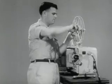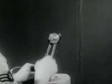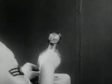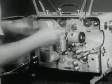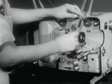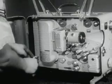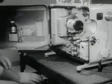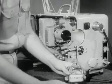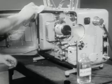It is a good idea to follow the same path as the film takes in your step-by-step inspection and preventive maintenance procedures. Start with the rewind belt and pulley. Make sure the belt is in good condition and the pulleys have the proper tension. Each film roller guide should be rotated and all dirt, lint, and film emulsion removed with an aperture brush. If necessary, use a clean soft cloth moistened with pure grain alcohol to soften the dirt and emulsion.